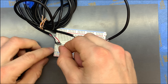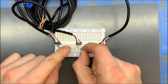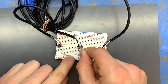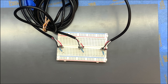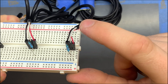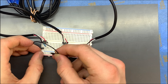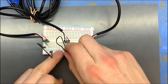Make sure when placing resistors that you leave one column alone — that's where we're going to put all of our pins so things are easy to see. Once the resistors are in place, one leg is in line with the power and the other leg is in line with the data for each sensor. Now we want to go ahead and get our grounds plugged in — black goes to ground, making sure they go into the ground rail of the power strip.